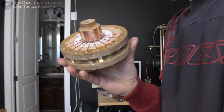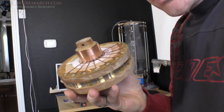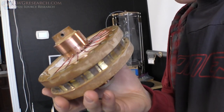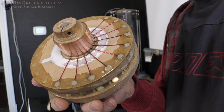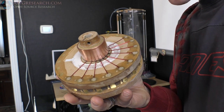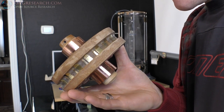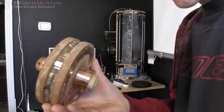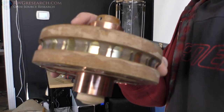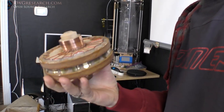So if you may be asking me, like, why didn't we just solder to the brass? Actually, most of that reason was because I epoxied this before I put the wires on, and I should have soldered the wires to the brass and then put the epoxy in, because if you would try to solder to this brass, then you'd melt the epoxy, and that would be very bad. So anyway, I can always coat this thing with new epoxy after I clean it and scrub it really good, and then remachine it to get back down to the surface if all else fails.